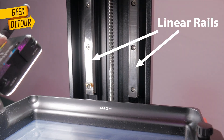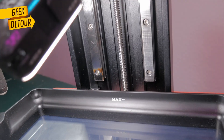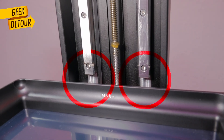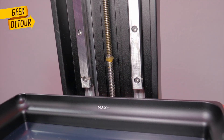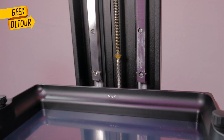This is tricky to see. On my Saturn 2, the linear rails were screwed directly over the paint or anodized texture of the bracket. But on the Saturn 3, they took an extra step — after finishing the bracket, they machined the places where the linear rails are mounted. You can see the machined aluminum; the texture and paint are removed, and that makes for a higher precision, flatter surface to mount the rails.